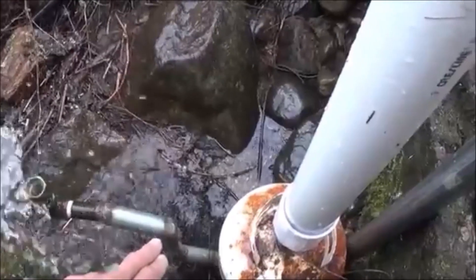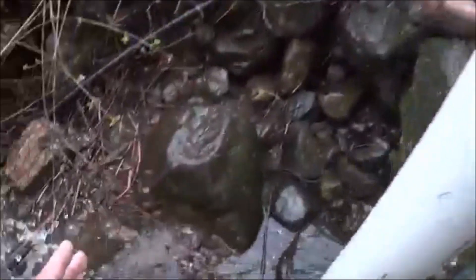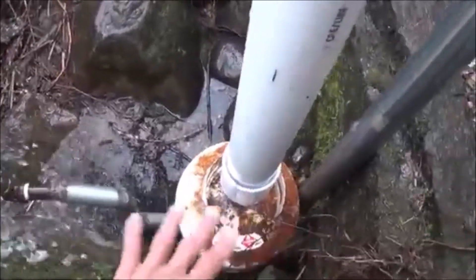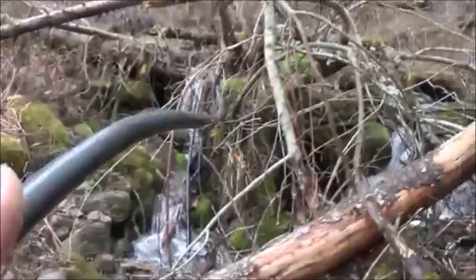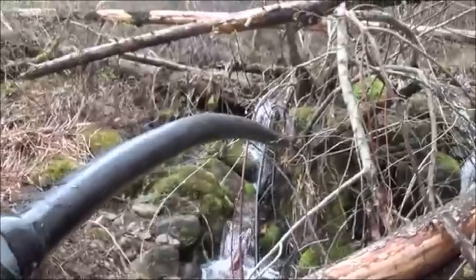Now, from the original film, I've shortened down the pipe on the end to bring it well down below here. When I brought it out here to test it, the output was really high, and with only that one inch of drop right now I wasn't able to get the thing to function. We're going to extend that back out when we're done and bring it all the way back up to height so we can bury this in the ground. But I just wanted to bring it out and give it a good test. Right now it's functioning as a Tromp hammer. We're getting higher PSI than what you should be able to get out of that much water inflow — you're really only adding into a very little water height on the outflow. Almost all the pressure is being generated from the valve shut. We're getting really close to 25 PSI. So if I bring this pipe 20 feet up in head and drop it down into this, we're definitely going to push well over the 50 to 60 PSI range. Even 8 feet of head, we probably hit that 50 PSI range.